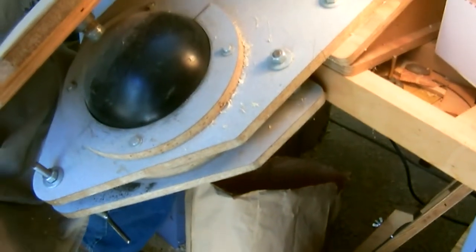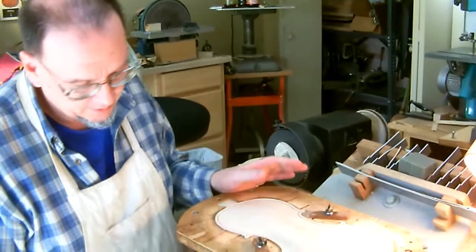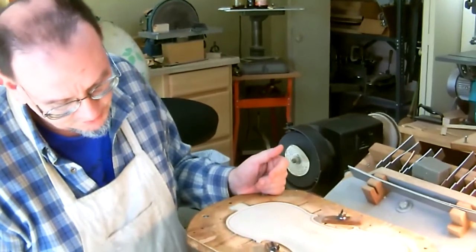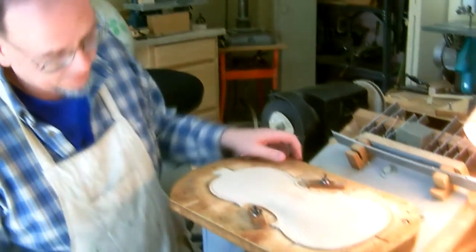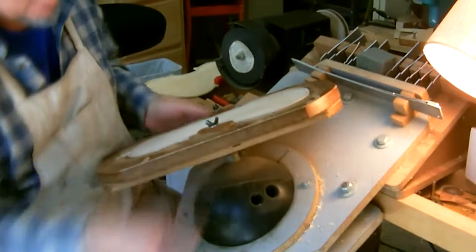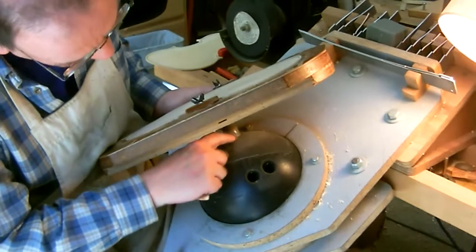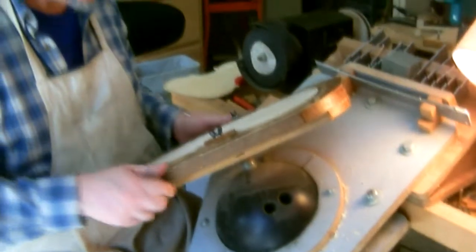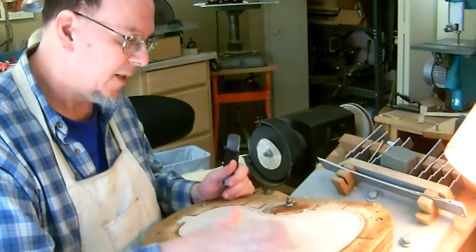Now Keith and Ray Dorr, they were both tool and die makers, so they were very much into making and using various jigs and fixtures in the violin making process to help with the process. And this is one of their, I think, particularly innovative ones. They took a bowling ball and the thumb hole of the bowling ball, they drilled and tapped it, and then put in some threaded plumbing rod and attached the plate holding fixture onto it.